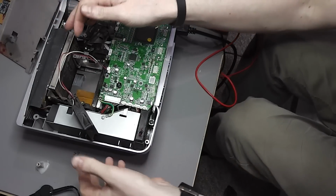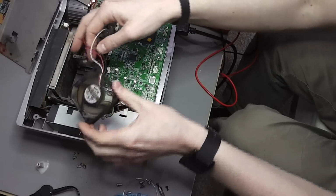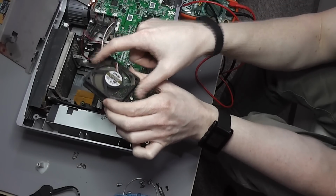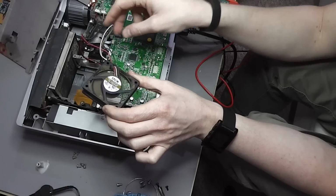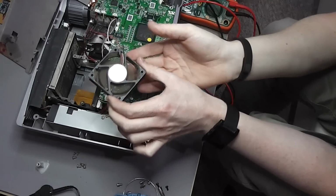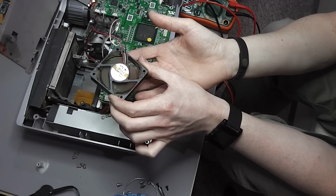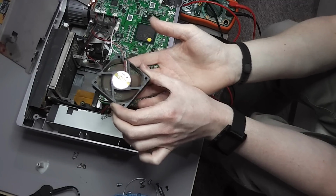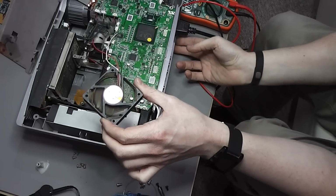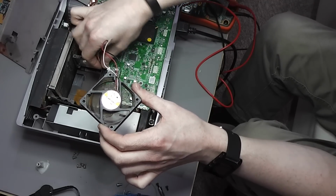So what I've done instead is plug this fan into one of the other ports, which has a known working fan on. It didn't work, so I switched the cables back over again, red for red, and the yellow, green, blue being the data line, and it's functioning. So it's the original plan. It's quite clear what was what there. And so at least I now know for sure what connection is what with regards to the fan's outputs.